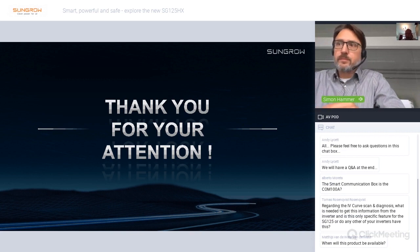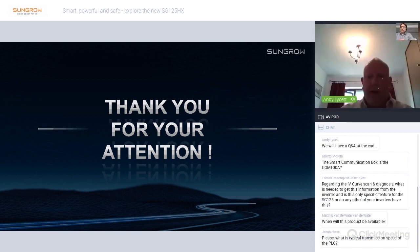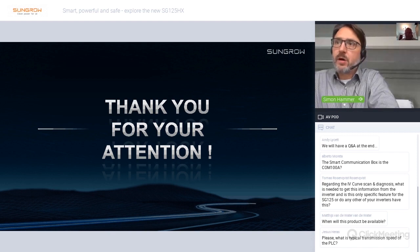A question from Thomas Rosenqvist is regarding the IV curve scan and diagnosis. What is needed to get this information from the inverter, and is this a feature specific to the 125, or do our other inverters have this? Regarding the IV scanning, what we have currently is that the IV scanning is available via our portal. But we are releasing next month also a PC software that allows you to do the IV scanning locally on your PC without the need of using our portal.